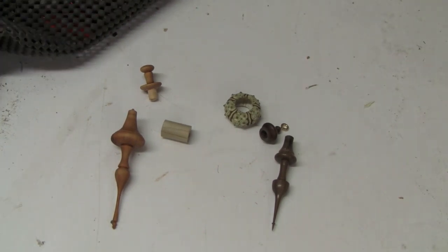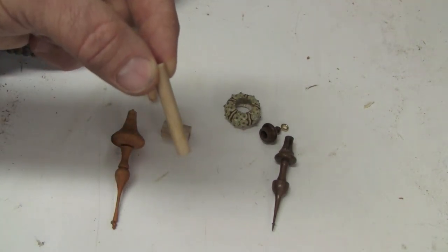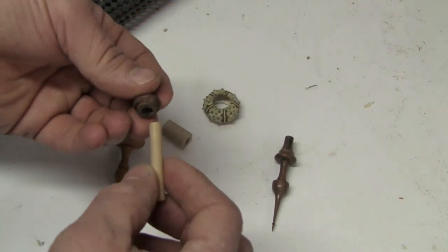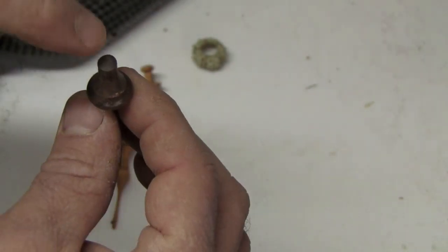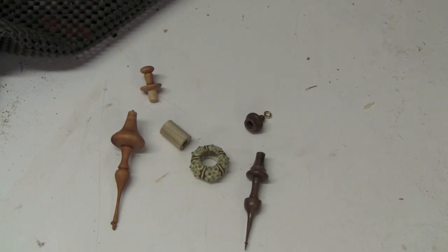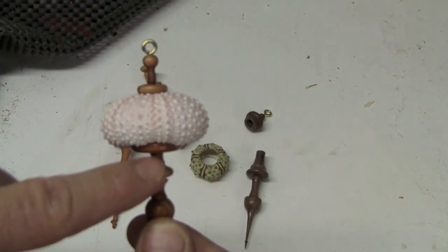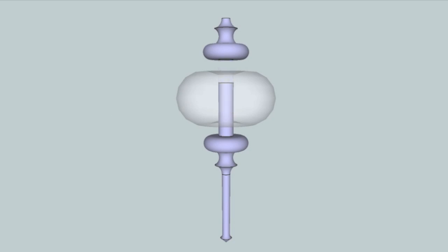The third method I tried was a floating tenon — using a maple dowel or standard dowel stock from the home center, with mortises on both the top and finial so the tenon goes straight through. The problem was there's no good way to make a mortise on the finial without going to the drill press, and it was very hard to hold in place and get it accurate. On one ornament you can actually see the top is shifted slightly because I couldn't get that hole just right.